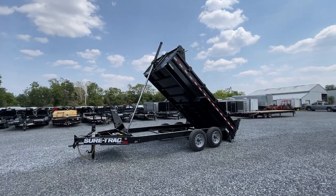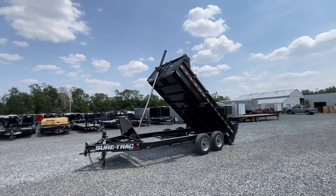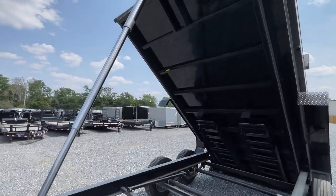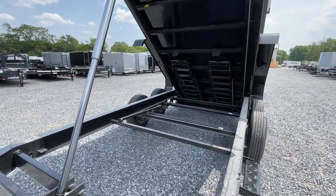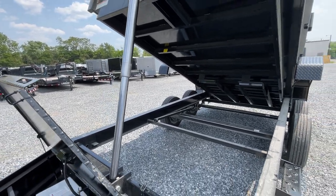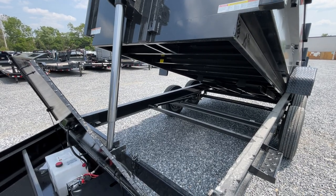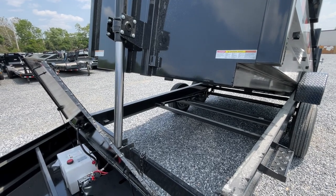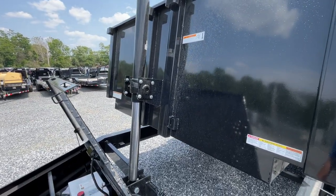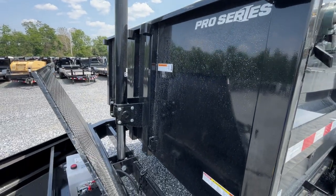Good look with it up in the air. I'm guessing the degree of angle is probably close to 50 degrees. Looks like I'm a little high in the front, so probably off by two or three inches on the level. Let me go ahead and put it down — it is going to be gravity down as would be your tellies. Stage one is pretty quick, stage two slows down a little, stage three slows down even more. What we find is it's about the same speed as dual piston and scissor, but at the end of the day, what most guys care about is whether it dumped the load. A telly is super efficient — it's three stage not one, front mounted not undermount, not trying to redirect force. It's already pointed vertical, not horizontal. It's just hard to beat.